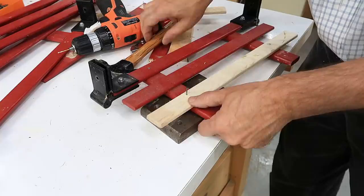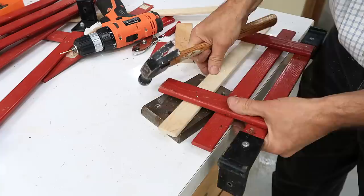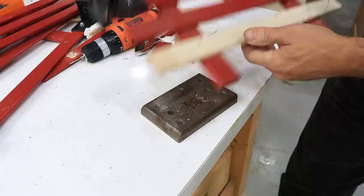For bending the nail over to the other side, I bend it over before it's driven all the way in, and then drive it all the way in, banging against the metal — that really buries the end of the nail in the wood.